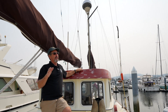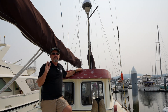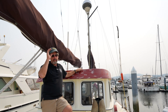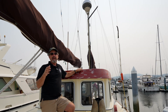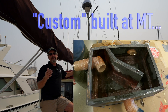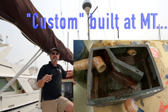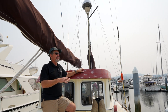We want to make the boat really quiet. Marine exhaust systems are very complicated, especially when they're custom, because if you get salt water in your engine, that's why a lot of boats have to be repowered. What we have is a water separator — we have a dry exhaust, but it starts as a wet exhaust and we have an exhaust separator. We want to show our students that they do this on a lot of generators, and there are a few boats with propulsion engines like this one that do that.